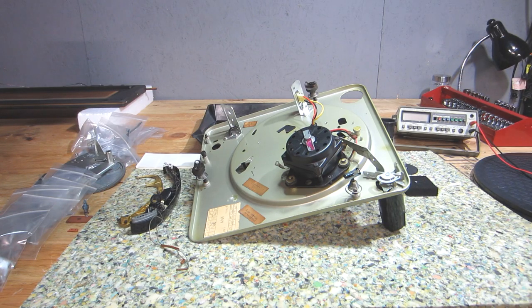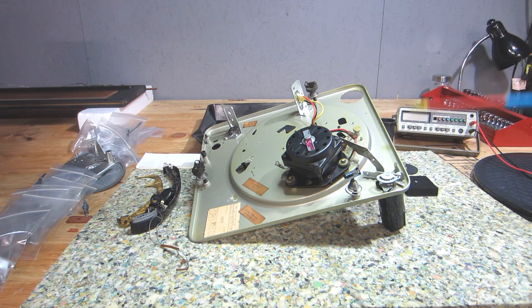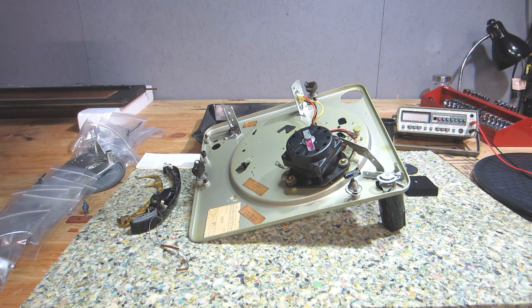And something that doesn't have a tendency to get sticky or gummy as it starts to degrade over time, because as I mentioned before, all lubricant will degrade over time. So again, I use a nice, clean, light, precision machine oil, sewing machine type oil, or even typewriter oil, stuff that's seen use in factories over the years. How many offices were full of typewriters back in the day, and typewriter servicing was a huge business. These are things those industries use that proved themselves over time.